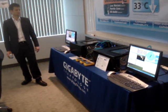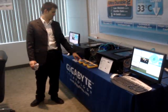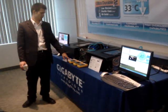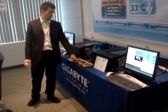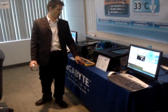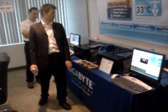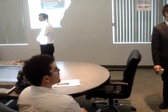Full loading, and the temperature difference right now: the P5K is at 76 for the choke, and ours is at 46.8. For the MOSFET, theirs is at 78.7, and ours is at 53.7. And for a capacitor, theirs is at 59.5, and ours is at 45.9. So this is definitely showing there's quite a difference between temperatures for the different components.